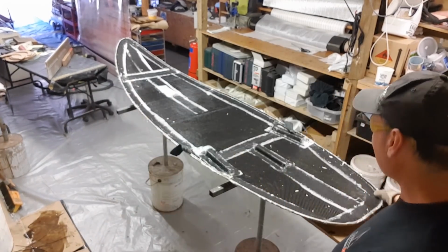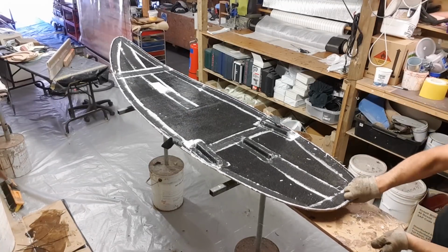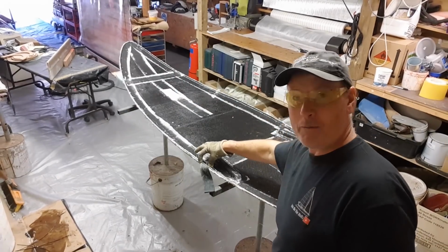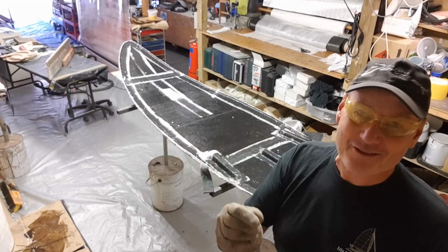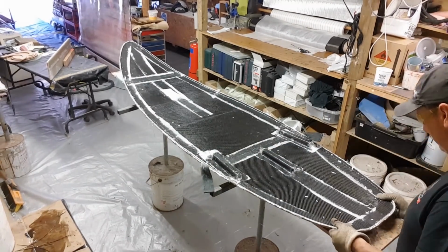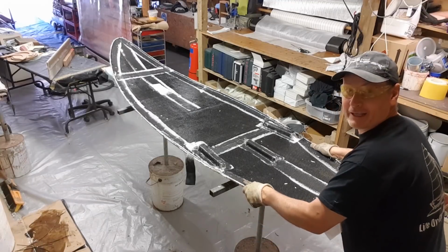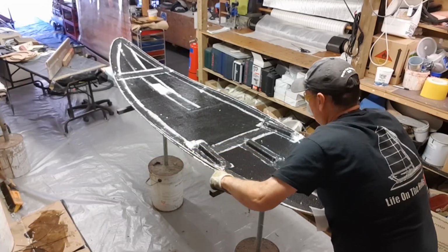So the next thing you're going to do is pull the mold back to me a bit. Sorry. All right, now that tape, or that webbing, is now abutting against these fin boxes, i.e. the plasticine and the double-sided tape. And rip my t-shirt, put myself against it, get hold of both sides of the tape and pull.